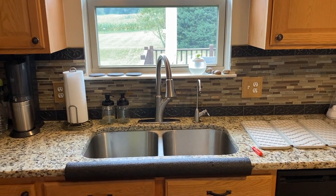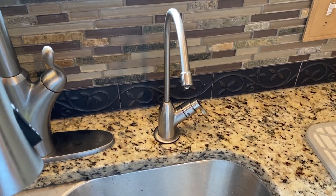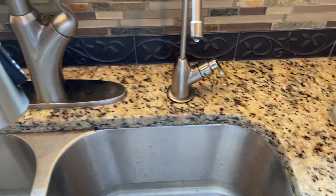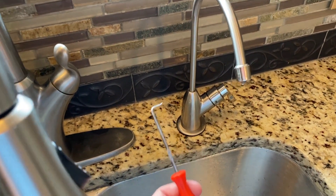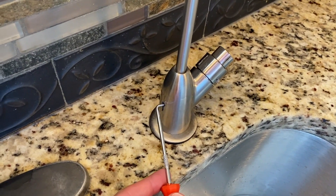All right, DIYers, in the kitchen now. In the event that your reverse osmosis is number one making a lot of noise — like gargling noises near the air gap — and the tank is not filling with water, before anything, be extremely careful and gentle as you insert a little pick tool like this into the air gap. It's very possible that your internal air gap is stuck.